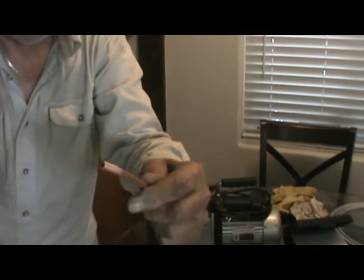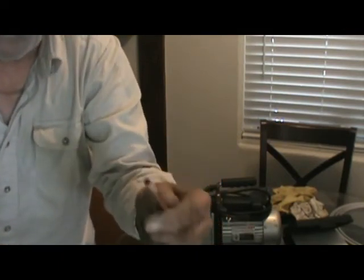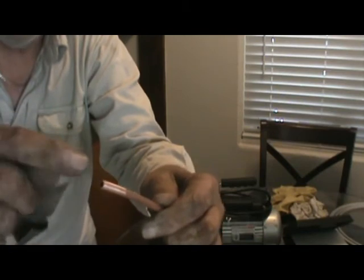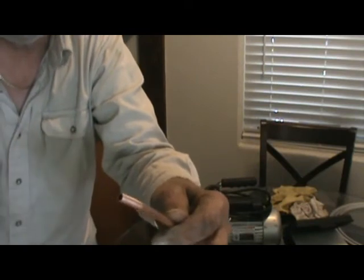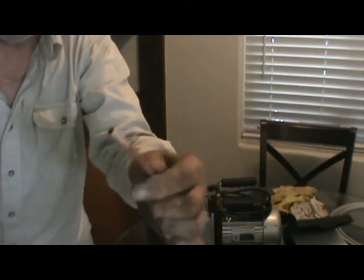If you have this nice and clean, put flux on, and if you have solder that has flux in it, still use white paste flux. Okay? When you put the heat on, it starts to get red, touch the solder on there, boom, it just wraps around. It follows, it chases the flux wherever the flux was. And you're off of it. And you have a perfect, just like a factory solder joint.